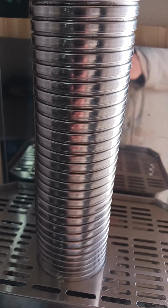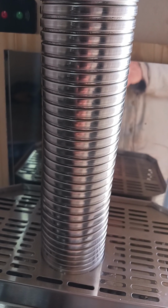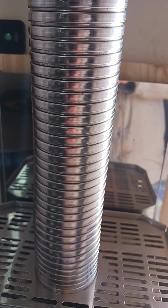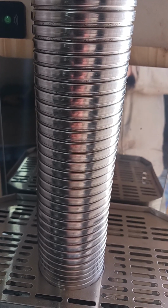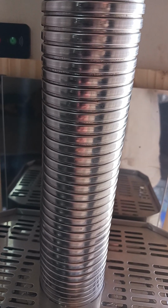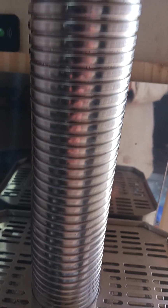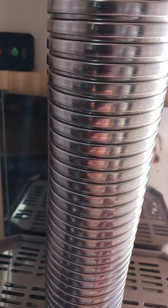So on the inside of this here, I had to use metal tape also, which is the high temperature flue tape, and I wrapped it around a couple times around the sleeve where I have to sleeve it. And then after I had it on there, I sleeved the inner pipe over that, and I got a better tight fit. And then of course the outer pipe goes over the top of that, and then that's where the air comes. Air comes in through here, and on the inner pipe the exhaust goes out.